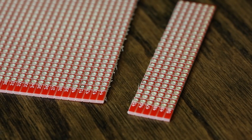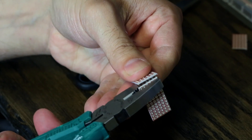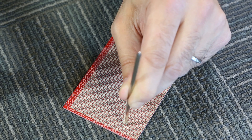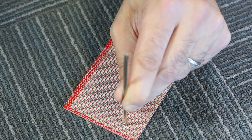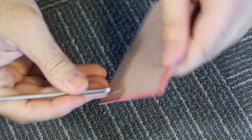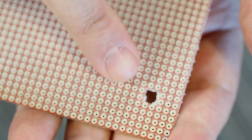If you end up with a few rogue holes left over you can snap those off with pliers. Pliers are also useful for snapping a narrow strip to length. You can also selectively knock out a few holes using a small screwdriver and a hammer — place the board on a surface that yields slightly but has a firm backing, like low-pile carpet over concrete or a folded t-shirt on a sturdy desk, and give it a good solid wrap. Flip it over, do it again, and you've got a small square hole.